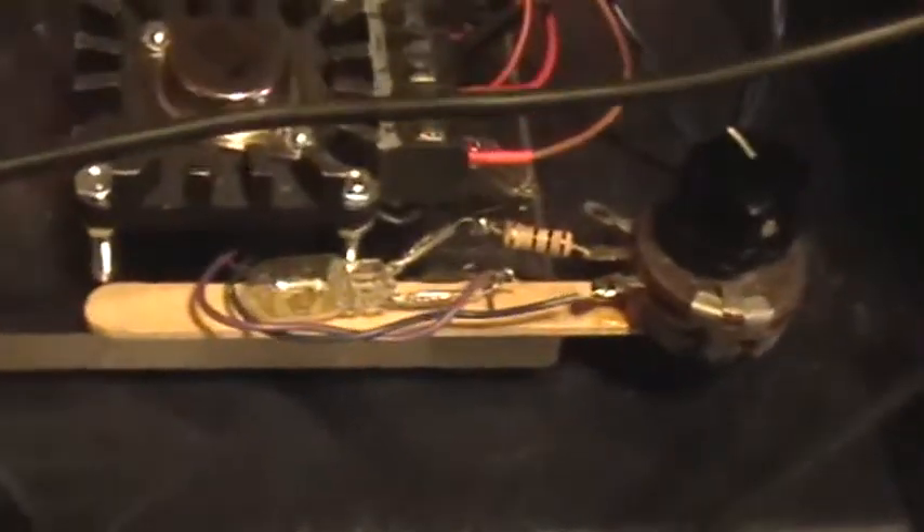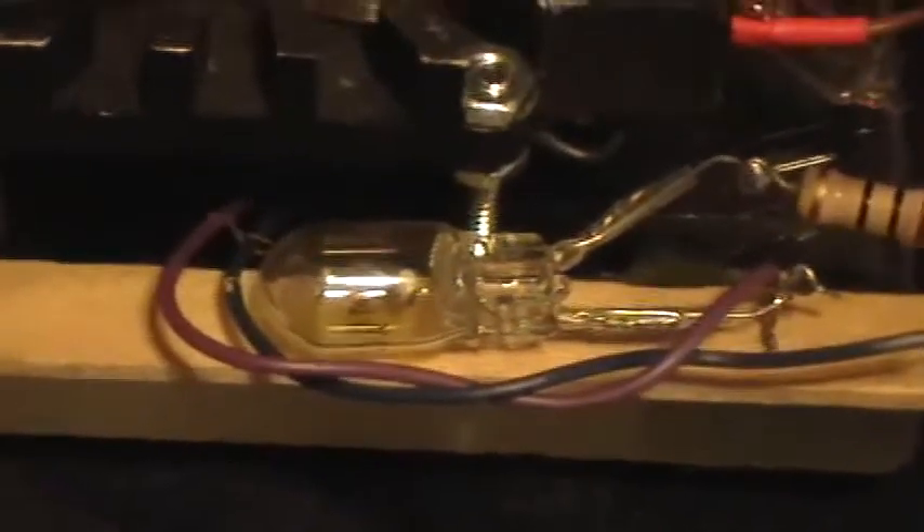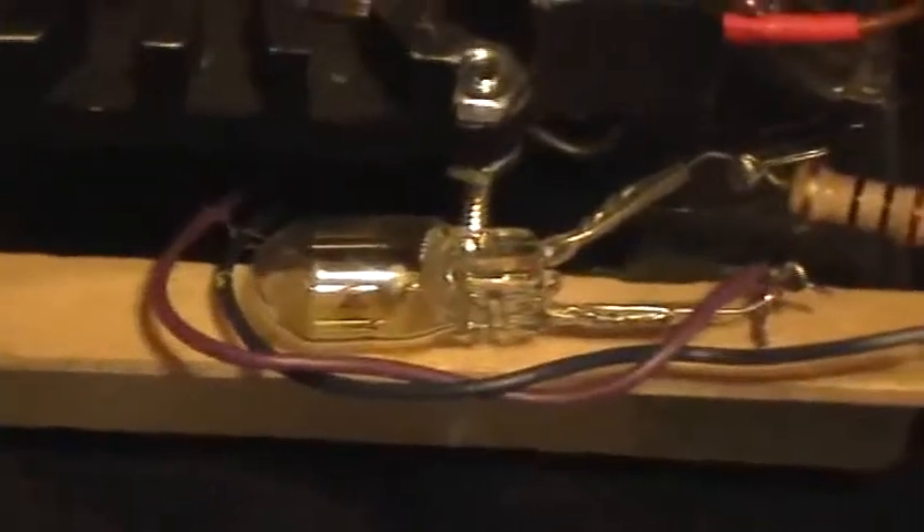I've added this little sub-circuit here for the base resistance. There's a potentiometer, a resistor, and a light bulb all in series. That's a little automotive dome light bulb, 5 watts. Its cold resistance is about 8.8 or 9 ohms. That's a 10 ohm resistor, and that's a 2.2k type J potentiometer, and they are in the circuit substituting for the base resistor.